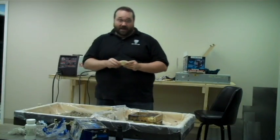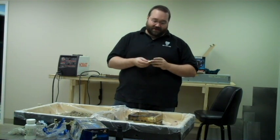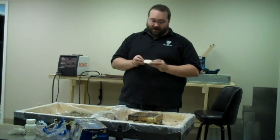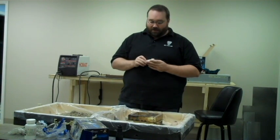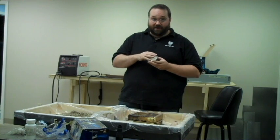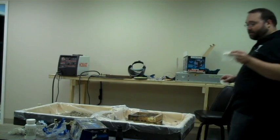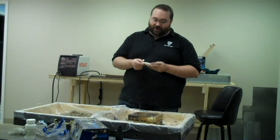The first thing you should know about MakerBot prints is that they leave ridges along the edges and inside all the surfaces. These ridges need to be worked out, usually by hand with sandpaper or an X-Acto knife. If you don't work the ridges out, the sand will stick to them and it will be hard to get a clean cast. You don't need to do it on all prints, particularly if the print has nice smooth sides — like this fish, for example. This fish doesn't need to be reworked. As a matter of fact, the plastic ridges make a beautiful pattern on it.